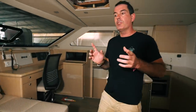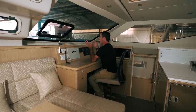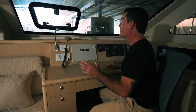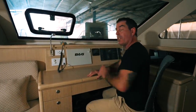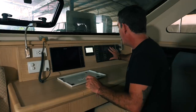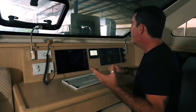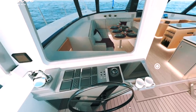The second thing we really wanted when we learned about the 1370 was the nav station. This is where you're going to sit — you're looking at height and the ability to see where your sails are. By moving my head six inches, I have more than 180 degrees of vision. We can sit here and look at battery usage, radar, AIS, and our position. We're moving to the C-Zone system rather than this, and in addition we've asked for a second autopilot control so you can quickly adjust from the nav station.